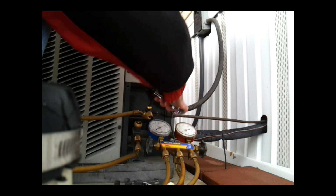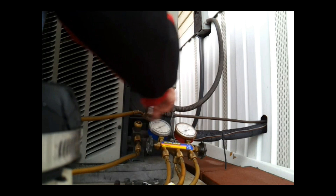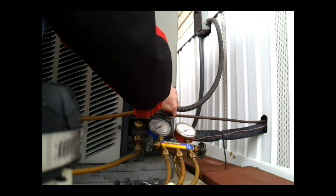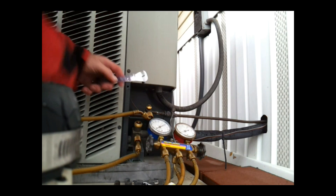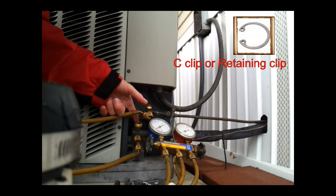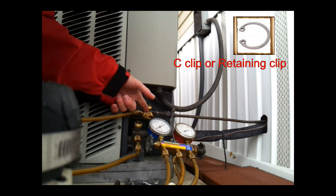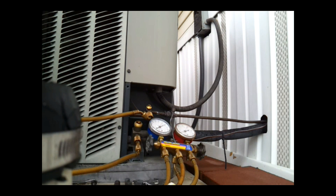Now I'm going to go ahead and lock off the high side. I will admonish you guys — if you haven't run across this before, when you lock stuff off, that's great, but if you back it back out, make sure you see the O-rings in these things. If there's a steel O-ring, look at the different models. Some of these, if it's not obvious or it's missing, you can back these out too far and it'll shoot like a rocket and you will dump every ounce of Freon out. I've had that happen before. Most people have at some point — you're unlucky and it is not a pleasant feeling.